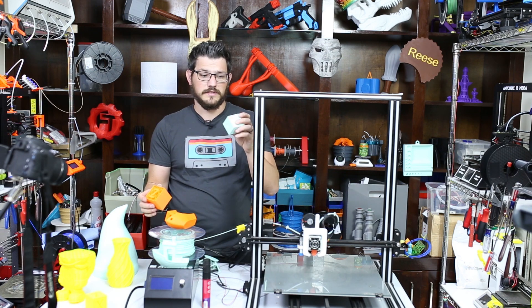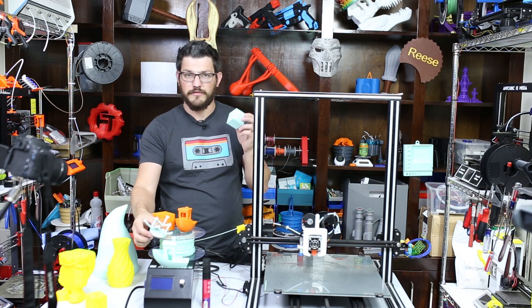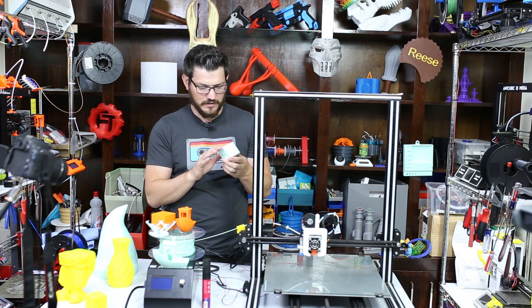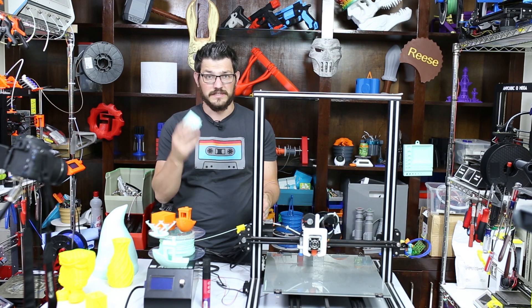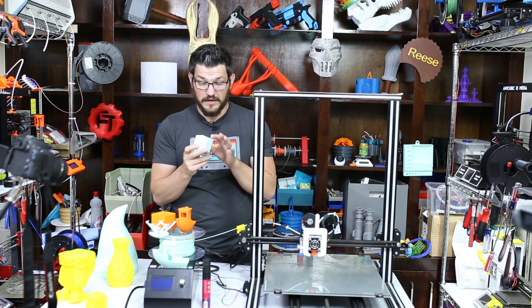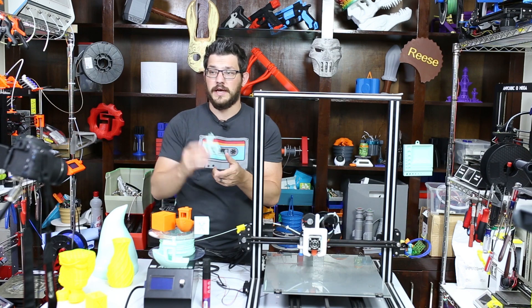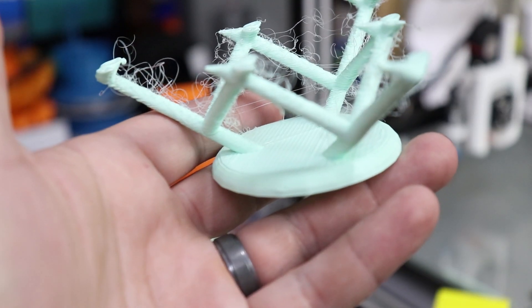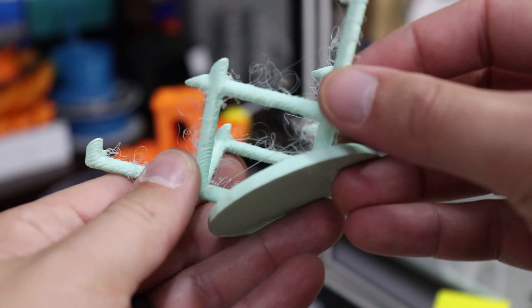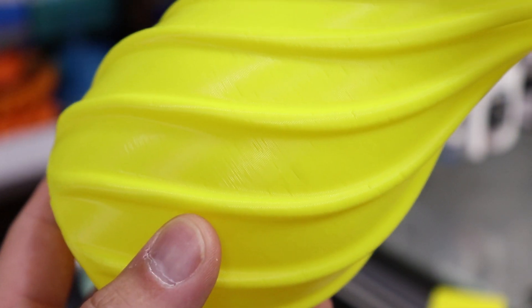This mint is from Filament One and it worked out pretty good on smaller printers, but for this larger printer at the larger diameter it's just not as good — there's a little inconsistencies. I can't tell if it's just this crummy extruder or if it's the filament. The filament printed great when I reviewed it — Y looks great, X is kind of meh, and it does pretty good top layers. I also tried one of these torture cubes at 0.32mm layer heights and it's super hairy so I ended up just stopping it. I'll try doing a vase — this is at 0.4mm and as you can see it's pretty good, there's a little bit of inconsistencies in it.